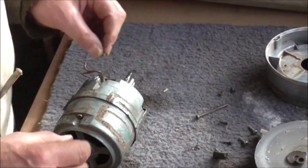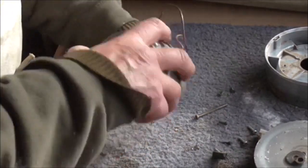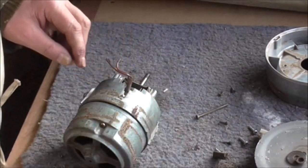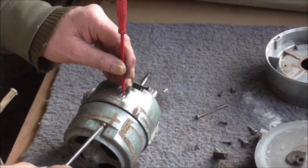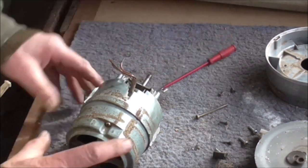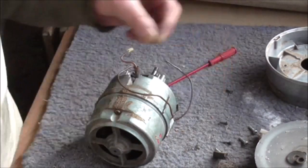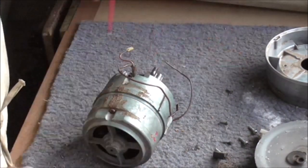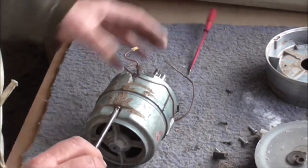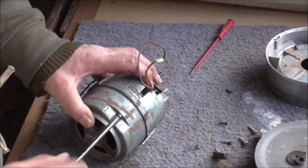There's a little nut there - I'll pop that in. Oh, it's gone into the motor - that's Murphy's Law, it'll go to the most awkward place possible. Anyway, I've got it back out now. I'm just holding the nut with a screwdriver as I do it up. Don't do one up tightly first - do the other one first, get that one assembled, and do them up gradually a bit at a time. There's the other nut - pop that in. Do a bit at a time, don't do it all one side at once; it's much better to do a bit here and a bit there.